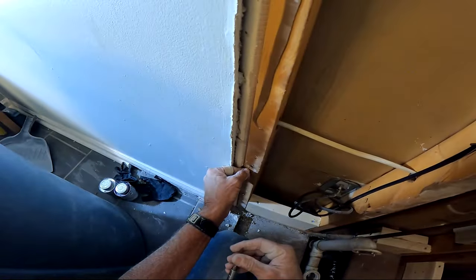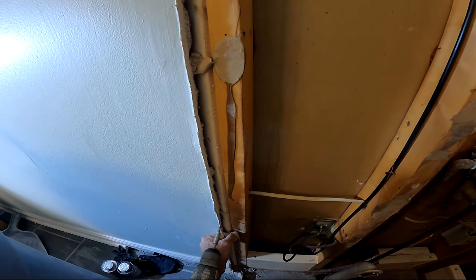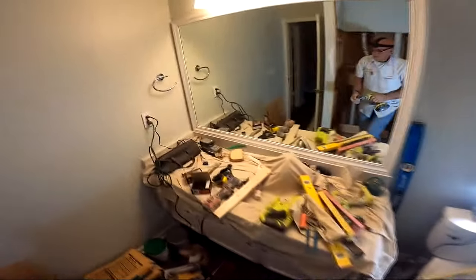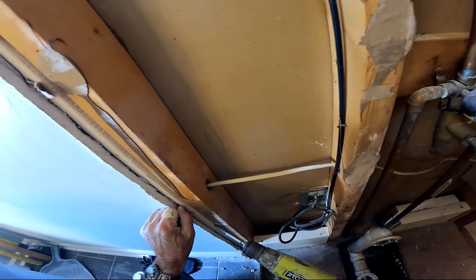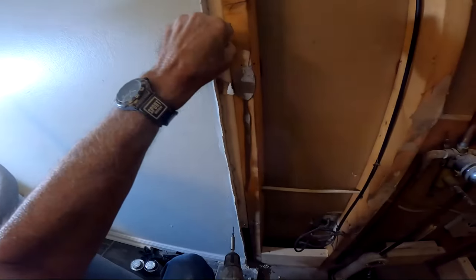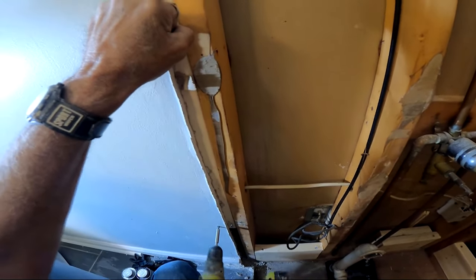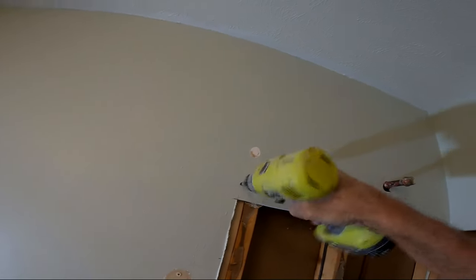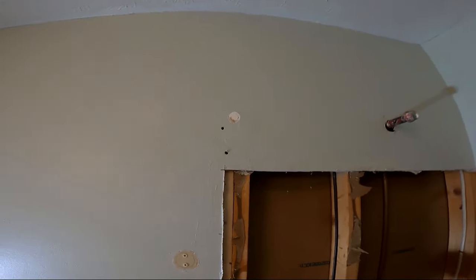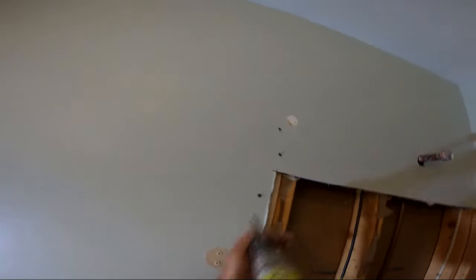This was an eight-foot piece I had to cut down to less than six feet, putting the larger piece up top and then about another foot at the bottom. I wanted that piece raised about four or five inches past the top of the stud so that when I come in with my screws I have enough of that one-by to screw into for a good solid anchoring.